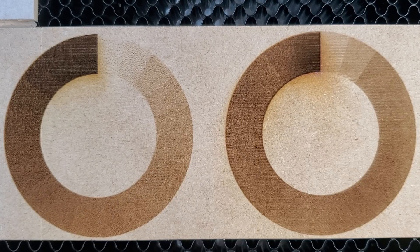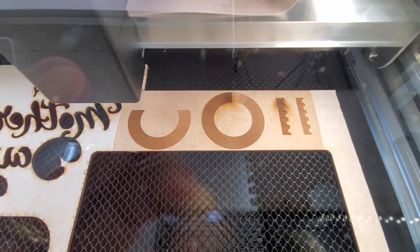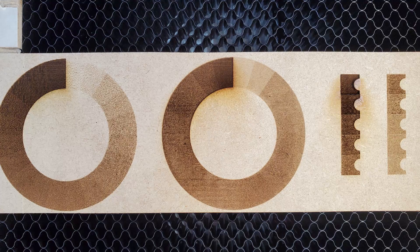Another thing you can see on this sample draft board is the impact of masking tape when used with engraving. Any engraving done with 20% power or less didn't even make it through the masking tape, so it didn't engrave into the board at all. Starting around 45% power, it engraved through the masking tape but still left the glue behind, which is hard to get off. This tells me I don't want to use masking tape for engraving with less than 50% power. Without masking tape, everything below 50% power turned out nice, but above about 85% power the board was stained from fumes.